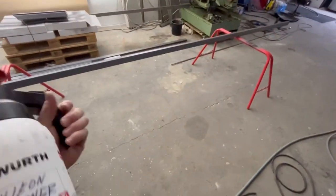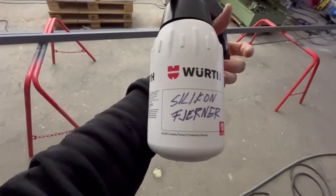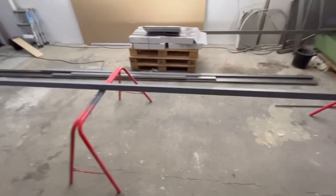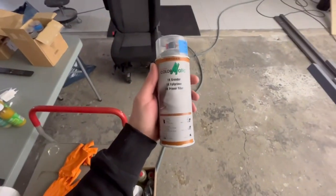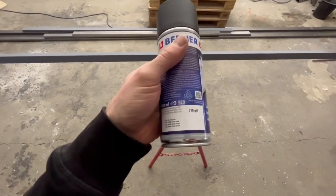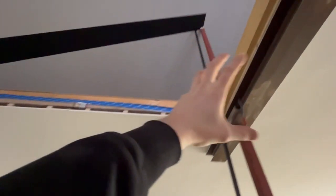Here's a little bit of the progress. First of all I cut it in my machine over there, then I clean it with silicone remover, then I sand it with my Mirka sander with 120 paper - so it looks like that. Then I put one component primer with ColorMatic. When that's dry I use my Barnér, my favorite black mat. The reason I do it is it's easier to just put some paint on everything before it's all up, than to mask everything after it's assembled. That's why I pre-paint most of it.